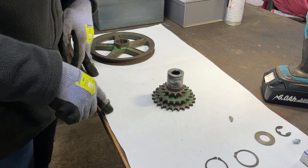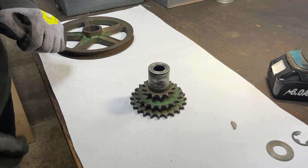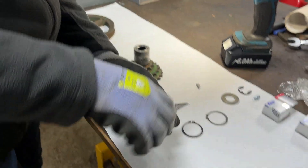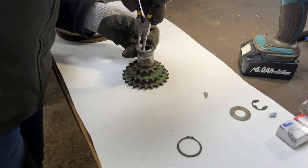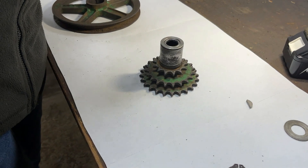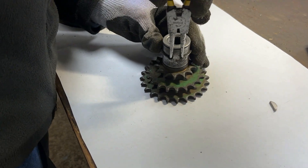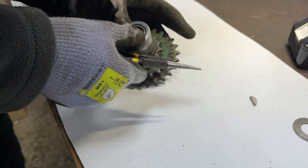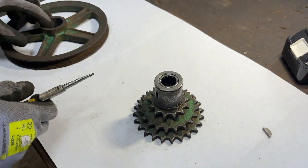What we have just done is gone around and tested the needle bearings to make sure they turn perfectly still after being pressed in, and they do. Next thing to go on is one of these circlips. That has to go down to the bottom slot. I've got that seated fine — so that circlip is now on there. That's a buffer for the pulley part.